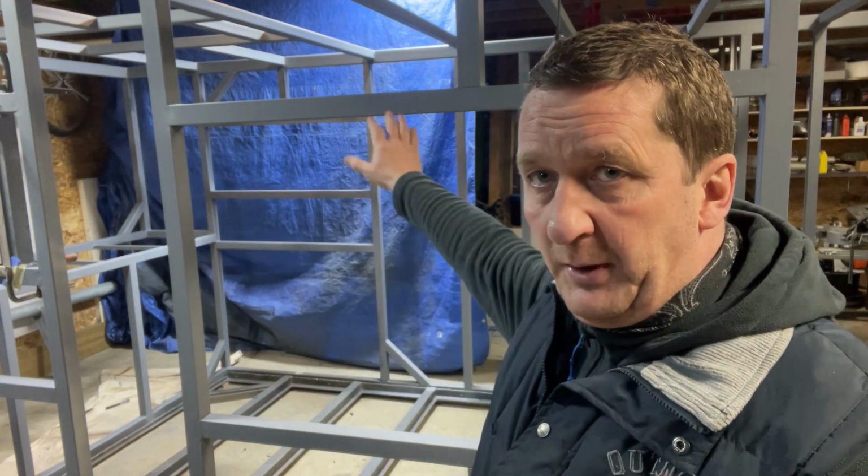I have never asked for a specific price, because for me it was always clear I'm doing it by myself. Initially, I was planning to build my structure out of aluminum, the bones, like you see here in steel. But I changed it for two reasons. The first reason was in 2022, when I made detailed plans for my habitat, I looked at the aluminum prices and they peaked at $3,600 US per ton. I orient myself on aluminum prices worldwide, and it was going up as it had never done before. That's where I changed my mind on the material, going from aluminum to steel. And I did that with confidence because I also learned when I took that utility box off that I need weight at the back, so it was okay to change to steel.